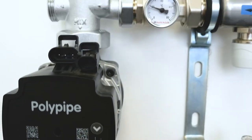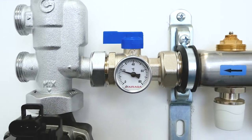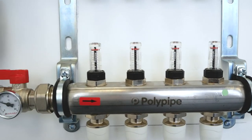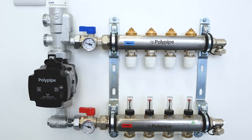The temperature gauges ensure we can read a mean flow temperature running into the system and a mean return temperature coming back. Moving on from the isolation valves is the actual manifold itself, which is an auto-balancing manifold unique to Polypipe. This incorporates an AFC valve in the manifold, which enables us to set a flow rate and it maintains that flow rate whether other circuits have shut down or if other circuits have been set up in terms of flow rate.